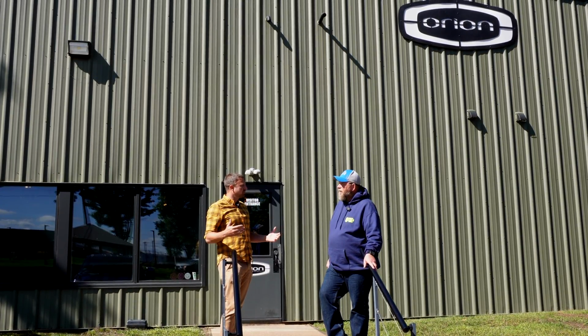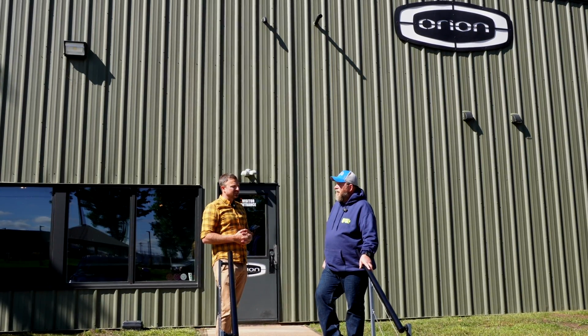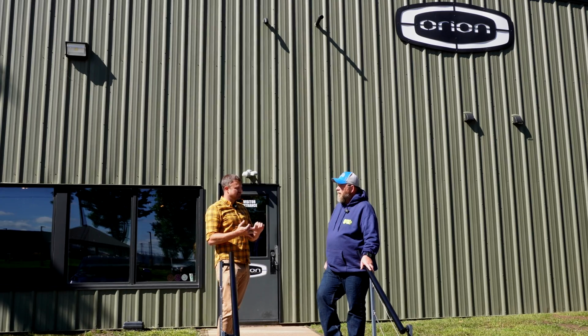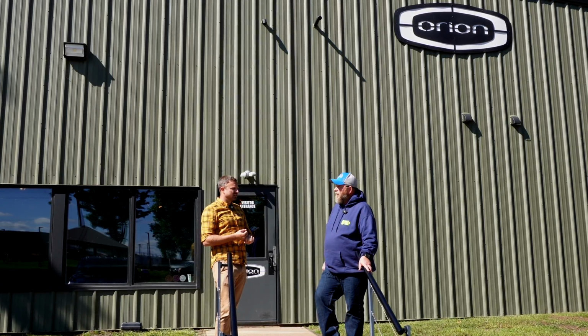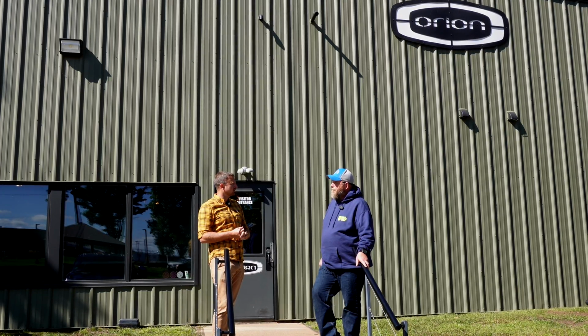And aluminum lasts forever, right? It's the same aluminum that you would see on an enclosed trailer, really. So we went to that. Now we have this really lightweight panel, and this 2 inches of insulation gives us great warmth for the north, but also the structure we need for snow load and moving around.